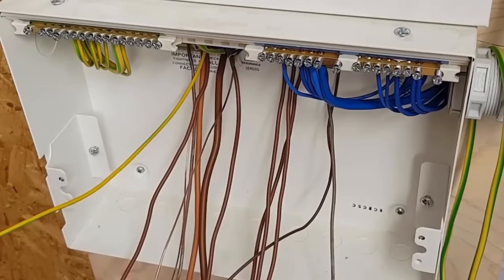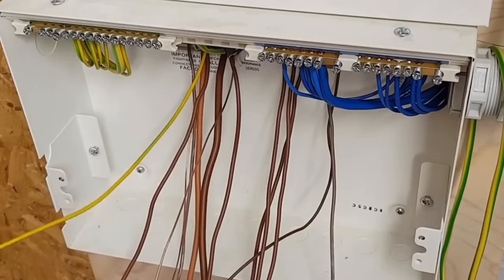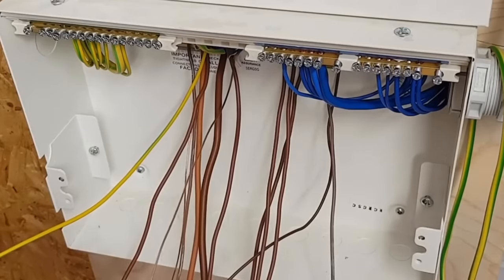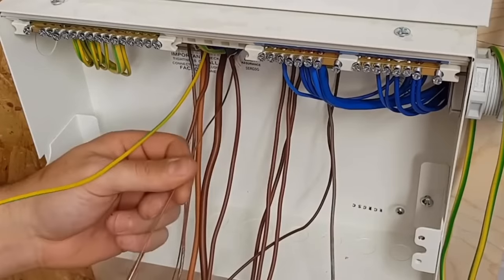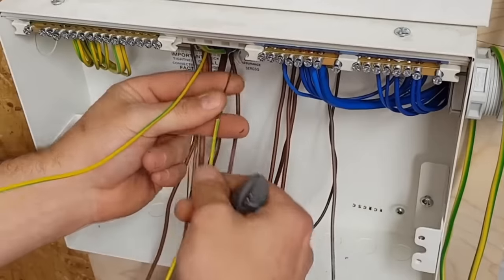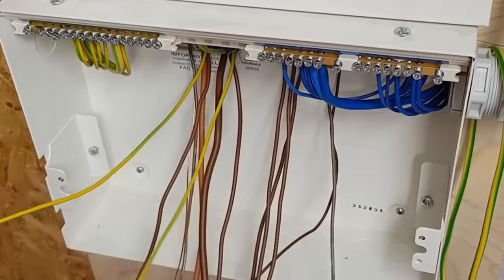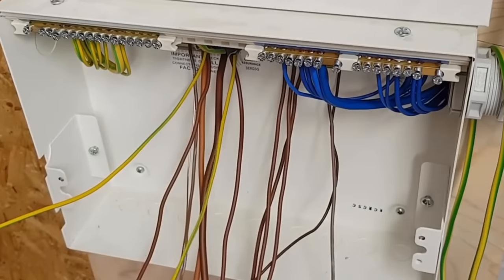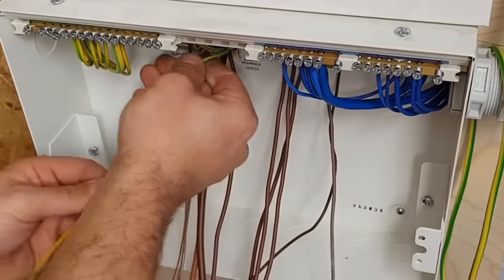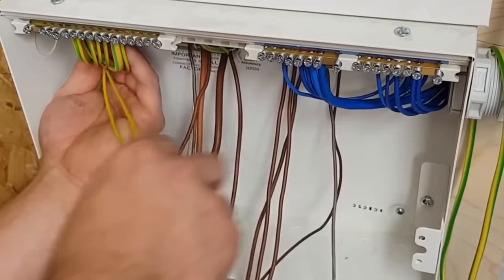I was in Spain recently and I noticed that a lot of the stuff in their consumer units is all double pole. And you sort of think of other countries as being behind the UK, and a lot of stuff they do was a bit weird, but it made me think, that's not a bad shout. I suppose with RCBOs they are double pole now, but when you isolate a circuit and you lock it off, you've still got the neutral in the back of the switch. Yeah. Or back of the socket. You haven't completely isolated it. If there was a problem, say there's no bonding or something like that, and neutral went down in the street, you're at risk of something going wrong.